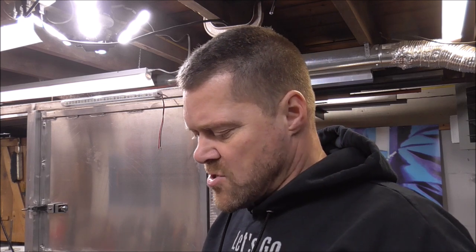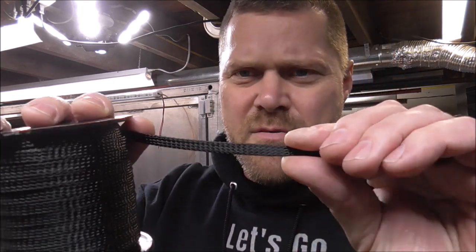Because this is going to be in a trailer going down the road with vibration, I always try to think about potential problems. The last thing I want is to have a problem when I'm doing something important — it'll never break when it's just sitting there, it's always going to be at the worst possible time. So to prevent any abrasion I picked up some vinyl wire covering and I'm going to slide that over this wire. That'll help protect it while it's inside this tube from vibrating around and abrading the wire. It gives it a little more protection. I'll have links to all this stuff in the description. I got all this on Amazon. In hindsight I wish I would have got a little bigger sheathing — it fits a little dry but it does work.